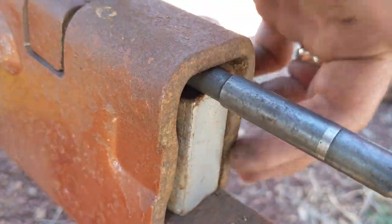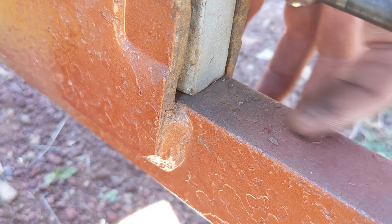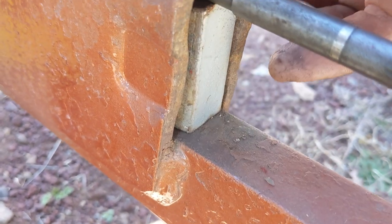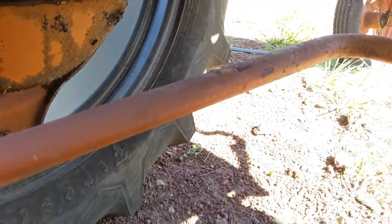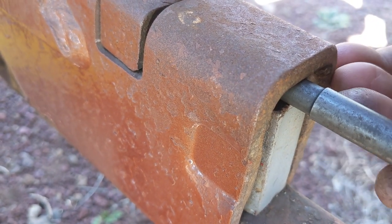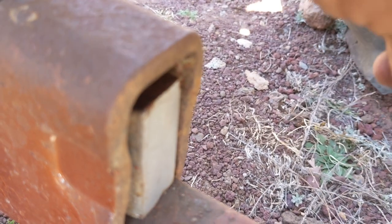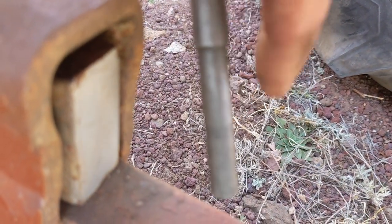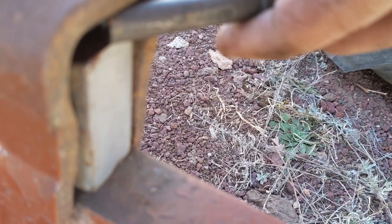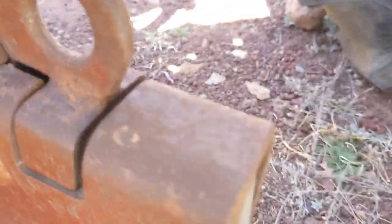With this 2-inch bar sitting flat up front and right on this drawbar. That's the drawbar, so I'm not quite sure what you call this officially. But anyway, I wanted to figure out now what is the space I've got to take up. So I just grabbed some reamer bits I had handy, and that's about the diameter I need. So I'll measure that and then mill down some stock, weld it on top so that it fits snugly in there. I'll taper it a bit like the real thing.